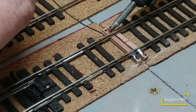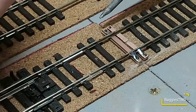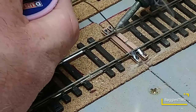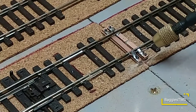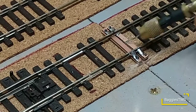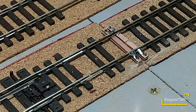Do the same on the other side. A bit more solder. There we go. You can see now the copper clad is attached to the rail with the solder, so when we drill through it here it isn't going to go anywhere. We'll just put another couple of tacks in there. I forgot to do that and it's just too much of a pain. We'll slip down the middle - we know we're not going to get any shorts through the copper clad. Happy days.